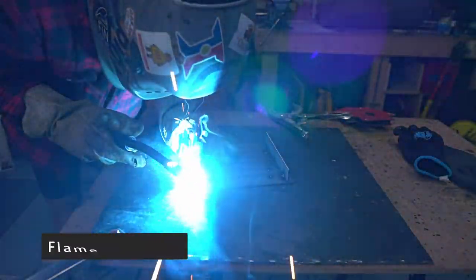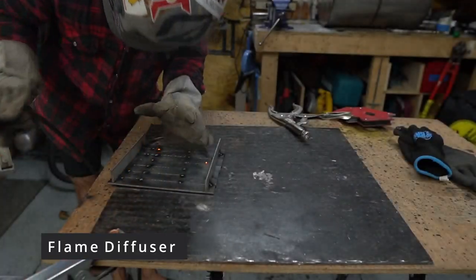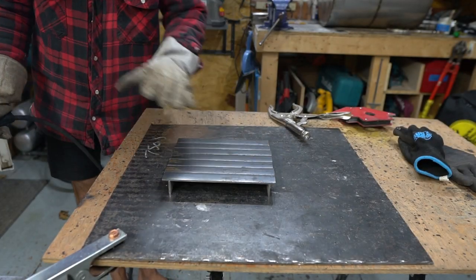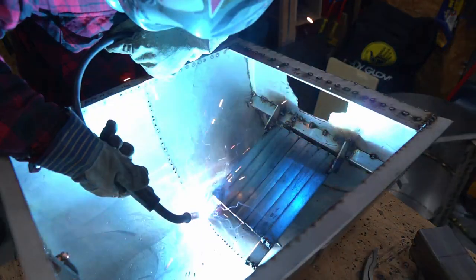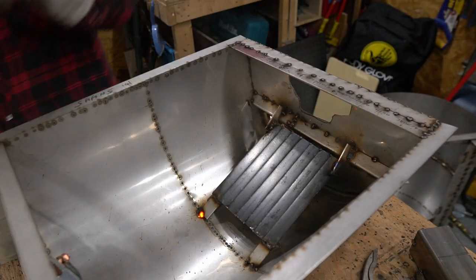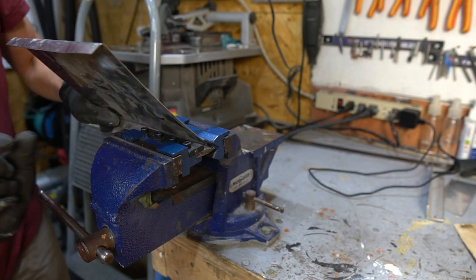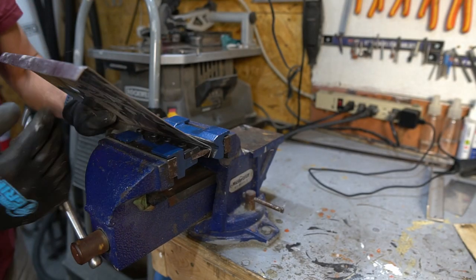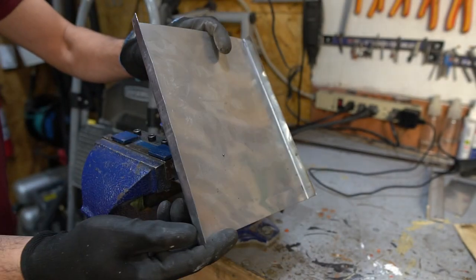What I'm making here is a flame diffuser. Effectively what it does is it redirects the intense heat from the burner across the ceiling of the oven instead of directly onto the oven liner where the flame has direct contact. I use mild steel as it has better thermal conductivity — if this was stainless it doesn't radiate or absorb the heat as quickly and it ends up being a hot spot. The remainder of the diffuser is made from bent stainless steel sheet.